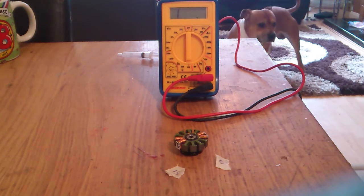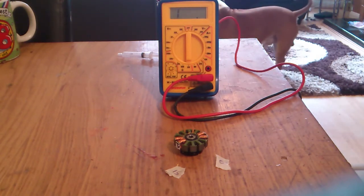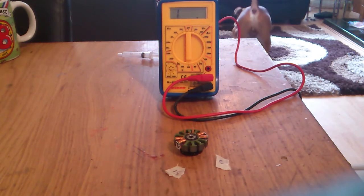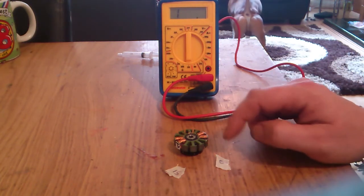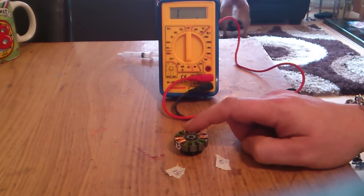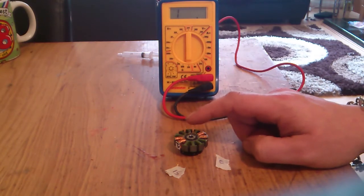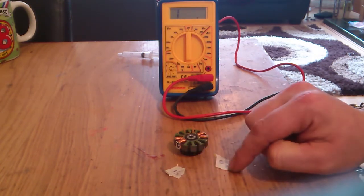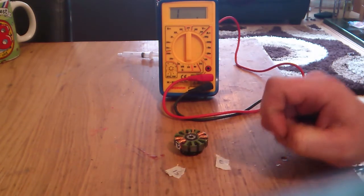Right, so that's the first phase wound. So now you've got to make sure that the phase is okay. What I mean by the phase is okay is that the coil itself, or the windings, don't short out with the stator. That's very important. And then check the overall resistance between the start and the end of the phase.